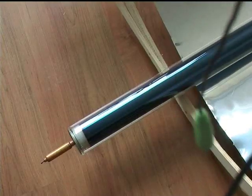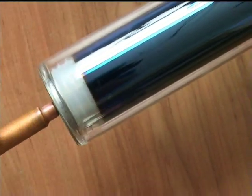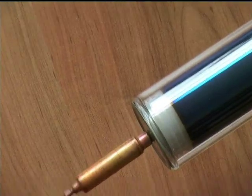I also have a vacuum tube. Here's the vacuum tube that I want to put in the focal point of this parabolic trough. It's a glass one and it's a little bit warm actually, and it wasn't even in the sun — it just had some daylight on it. This type of vacuum tube has a heat pipe in it, so you have to tilt it upwards so the liquid that vaporizes can end up at the top, and then you can siphon off the heat from this copper thing. These ones are 20 euros, so it's not very expensive.